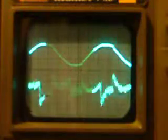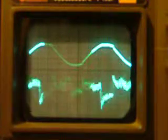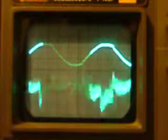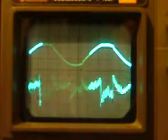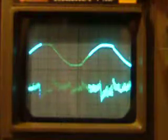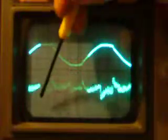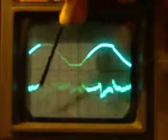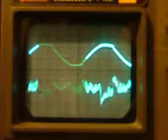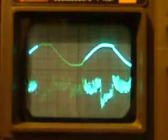The probe is on the gain pot for the second gain stage, connected to the wiper — the middle connection there. This is pretty significant and it's displaying well the effects that the switching is causing in the tubes. That's one more tidbit along the hunt that I found. Thanks for watching.